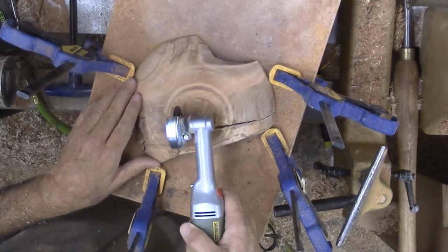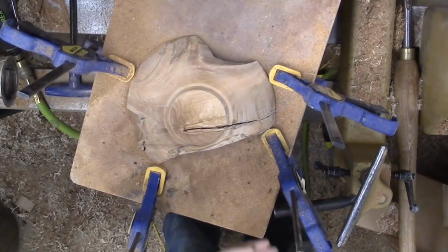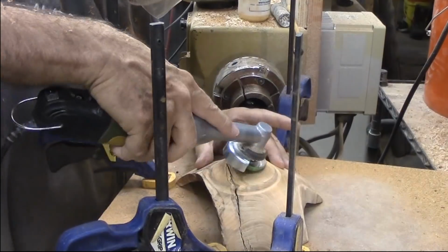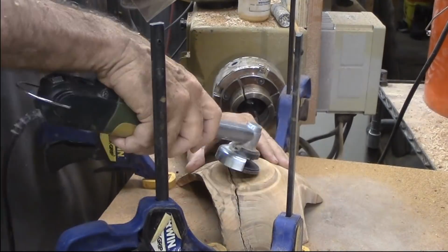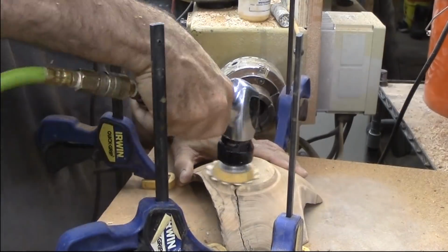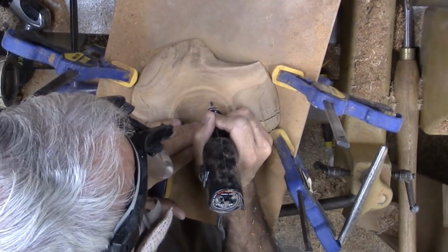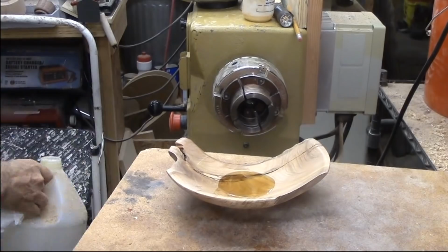Instead, I'll dress the foot with my long neck angled grinder. I'm starting with the cutting tool and switch to a rasp tool. Clamps around the bowl provide support. And switch to a coarse flapper sander. And back to the air sander through all the grits. I'm sanding this bowl with a Dremel engraver. Finally, a bath in walnut oil gives it a nice sheen.